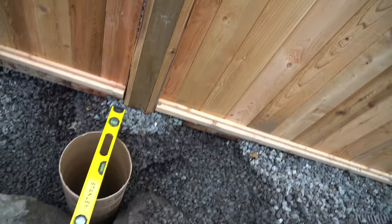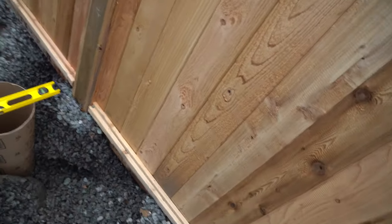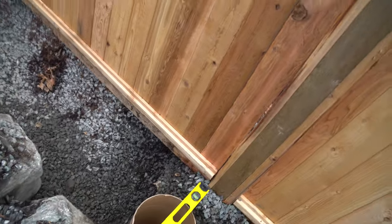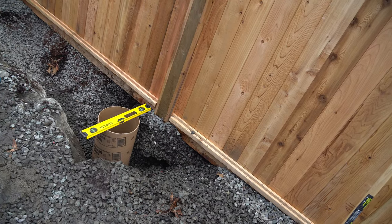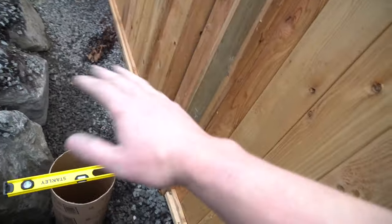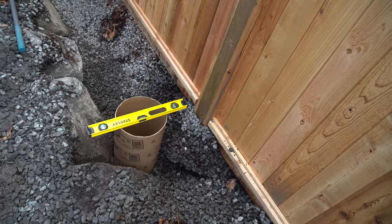Time to backfill up to that line. I'm going to have maybe a couple inches of tube above grade — I usually would have gone a little more, but I wanted to get as much of that pillar in the ground for stability as I could. So now the saddle can go on top, and when I do my flashing it'll cover the saddle. If there's a little bit of tube there, I'll trim it to the ground. That's how you do it — I get to repeat it on the other side, which is going to be harder because of the slope.